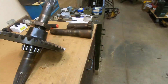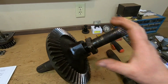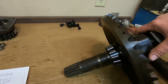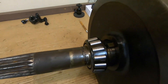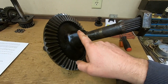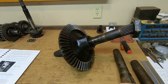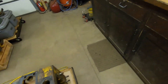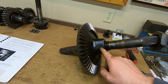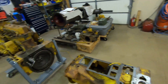Instead of trying to look in the back of 1113's housing in that rather small compartment where half the things we want to see are already hidden, I just pulled 2115's old bevel gear and shaft out and put it back on the bench because all the details are the same. One question that came up: isn't there supposed to be a key installed between the gear and the shaft? Yes — I put the key in. But is it the key that prevents the gear from turning on the shaft? We'll say yes, but primarily no. The key is kind of secondary. We pressed the gear onto the shaft on 1113 at 12 tons of pressure, so to a small extent that actually expanded that tapered hub onto the taper of the shaft, and just that taper is enough to hold a lot.